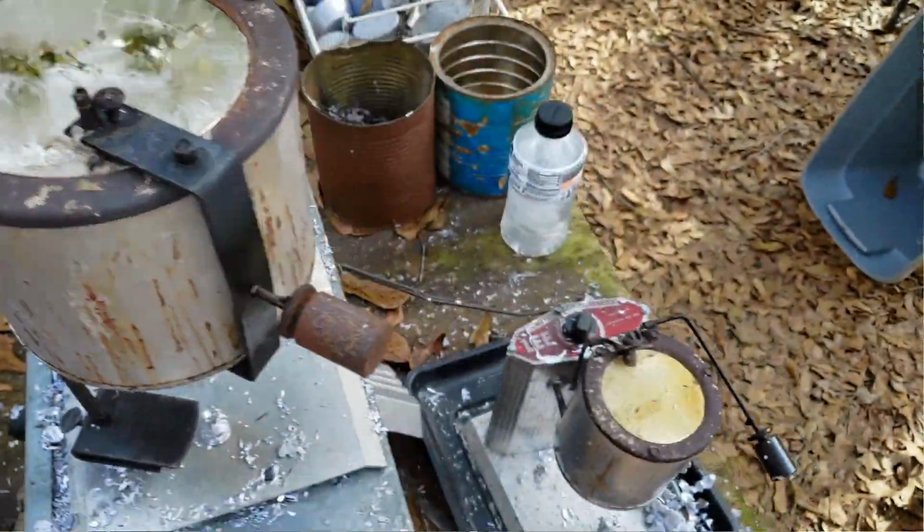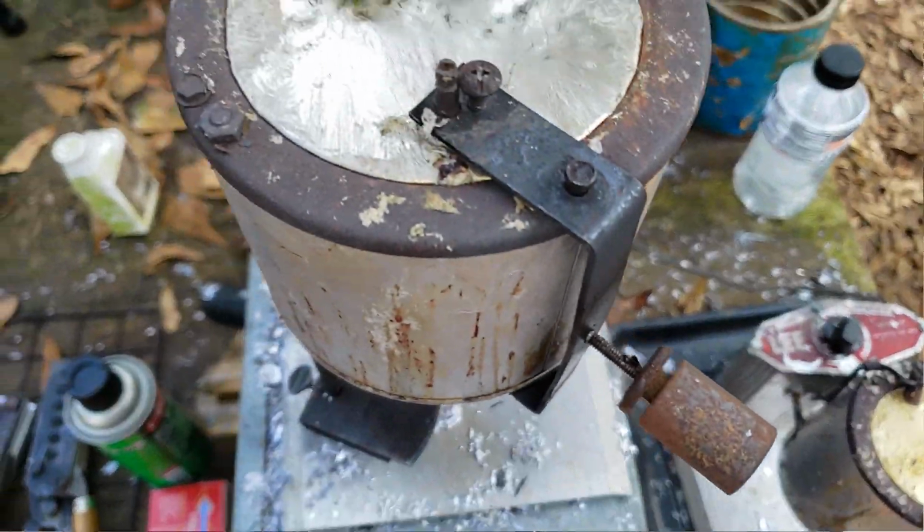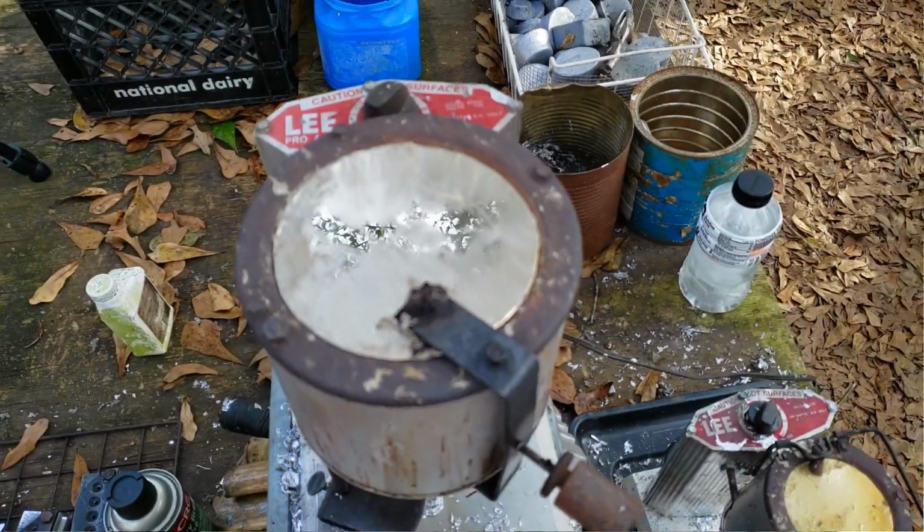And with me, I'm working fast with a 10-pound pot and with a 20-pound pot. And when you're working fast, you're continuously dropping cold alloy back into these pots. And that's why I have two pots, because I'm bouncing back and forth between the two. And all of that is contingency. All of that is variables that are thrown in this equation that can cause multiple different scenarios to play out whenever you are molding up your shot of whether or not you need to treat your mold or not.